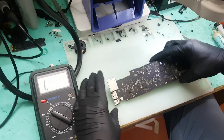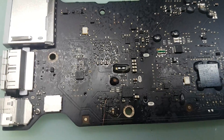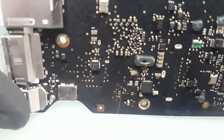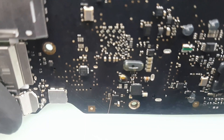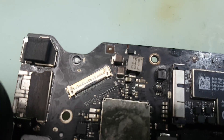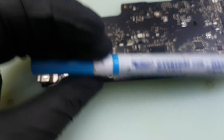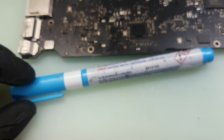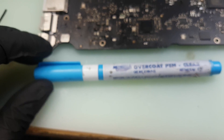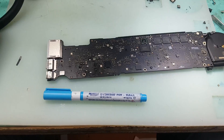We made this circuit to run a wire to it. Run it like this — the good thing is you don't really need to go under the IC, because there's a little bit of edge where you can remove the coating and make contact, and then it goes back here. Now I'm going to put this overcoat pen which we use — it's from MG Chemicals. There are two types: one is green, and this is the transparent clear one, which I mostly use. These are good, you can use them. That's it for today guys, thank you very much.